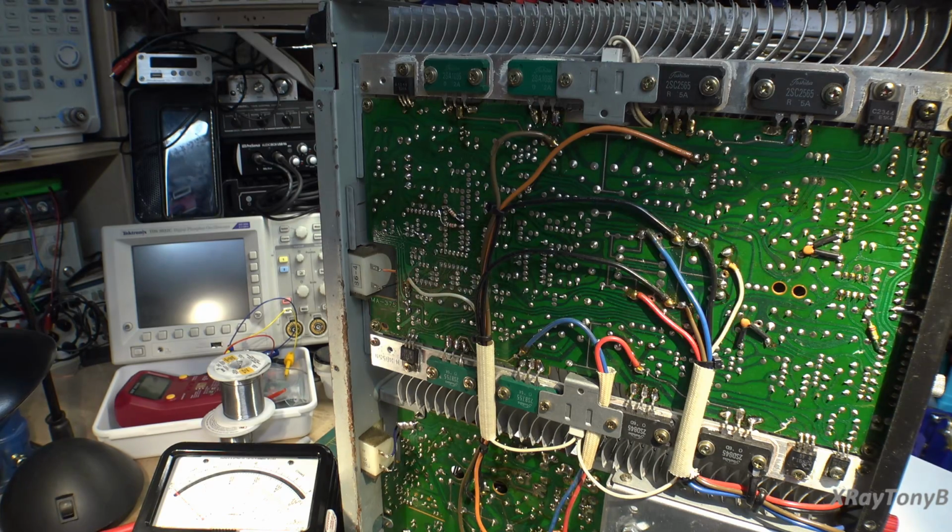Anyway, I just have an analog meter here, and there are a couple reasons. Number one, if you have an analog meter, it makes it easy when you're spot checking for this test, because you can just watch the deflection of the needle and note where it falls on the scale. The other thing is, being a 20,000 ohm per volt meter, it has a lower impedance than a digital meter, so it actually puts a wee little bit more current through the circuit when you're testing it to overcome some things. So just for those couple of reasons, I like to use this. You can still do this test with a digital meter, and it'll probably work, especially if you put the meter either in diode check or in continuity mode.